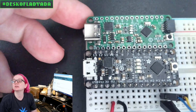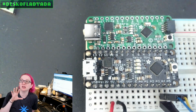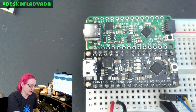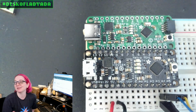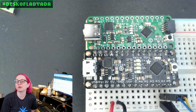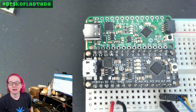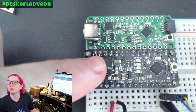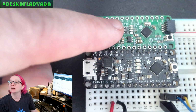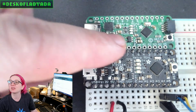And I'll show the difference. It's the same size, same pinout, same mounting hole and GPIO locations, but a couple things moved around. One, I moved to USB-C because that's kind of standard and people are expecting it. I'm trying to make it so any new boards, unless there's a really good reason, go with USB-C. And a lot of 0805 parts got shrunk into 0603, and these LEDs are 0603 now, so you can see they got shifted over to the left.